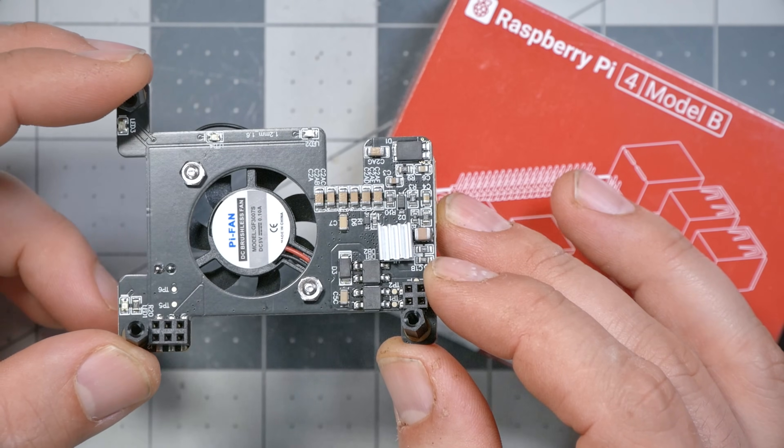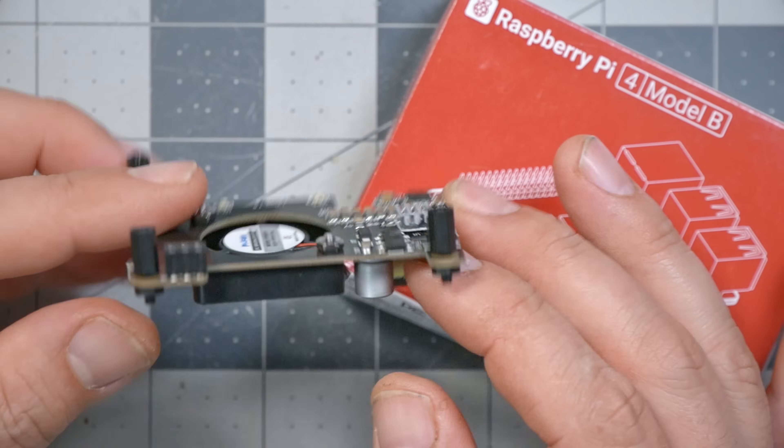In addition to the Raspberry Pi, I have purchased a PoE hat. PoE means power over Ethernet, and a hat is basically just an expansion board for a Raspberry Pi that sits on top of it — hence, hat. PoE means that we will be able to power the Raspberry Pi over the same Ethernet port that we use to get data and stream over the internet. You can also power the Raspberry Pi via USB or simply with a DC input on the 5-volt and ground pins, but there are a couple little quirks with doing that.